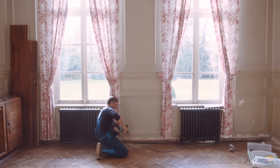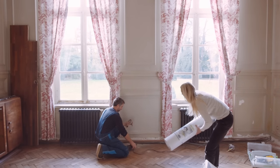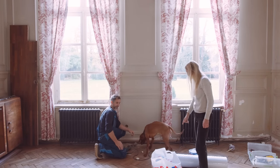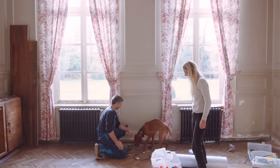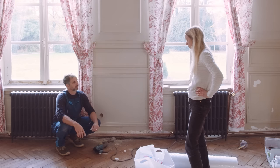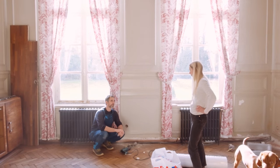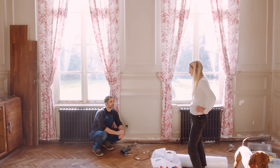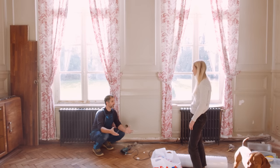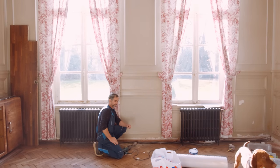Anna arrives: 'Oh, you got started already.' I'm doing the holes for the plug sockets. She asks if I measured and whether they're in the right place. She mentions she was going to protect the floor before we started, but I'd already begun. I can make eight plug sockets because in France the norm says on a 1.5 square millimetre cable you can have eight plug sockets on a 16 ampere fuse. Anna tells me to take care of the electrics and stop showing off; she'll handle the painting. I say it's not showing off — I'm giving tips and educating people.